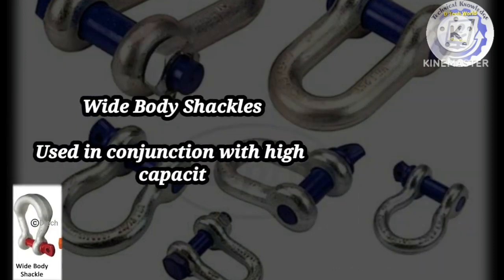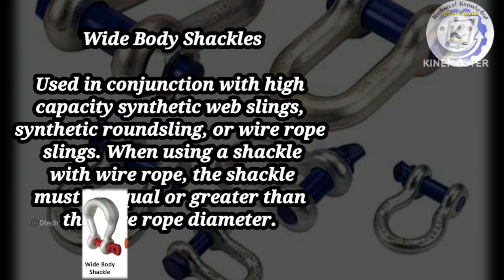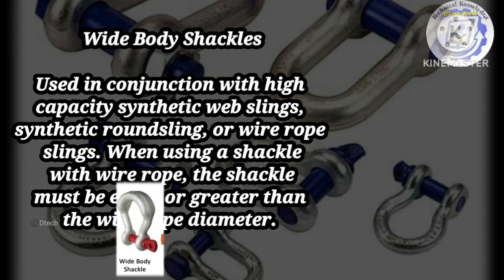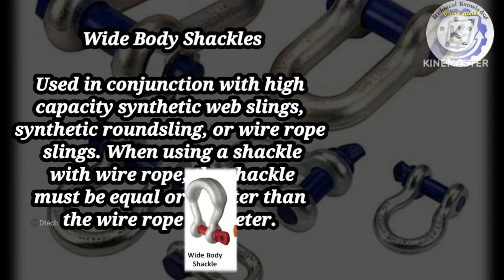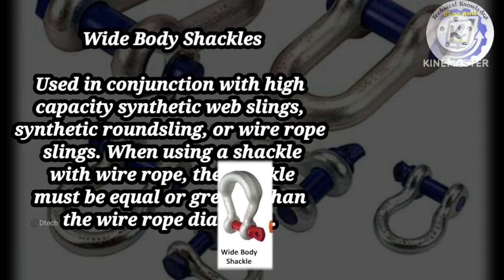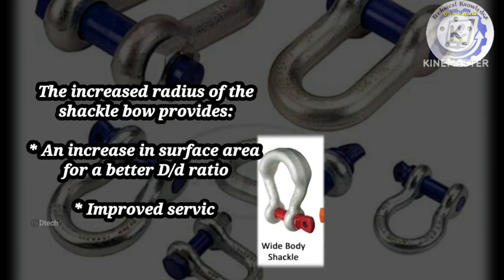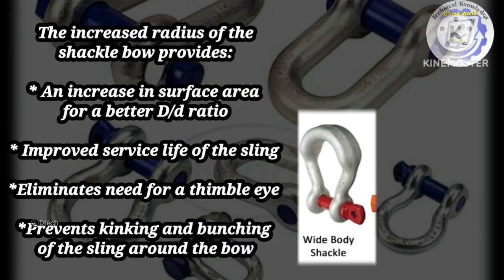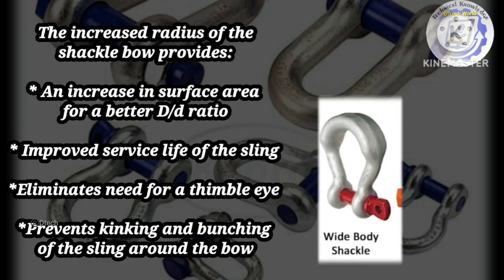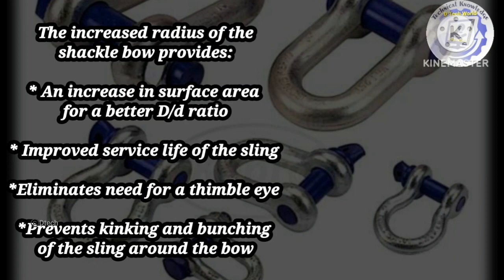Wide body shackles. Used in conjunction with high capacity synthetic web slings, synthetic round sling, or wire rope slings. When using a shackle with wire rope, the shackle must be equal or greater than the wire rope diameter. The increased radius of the shackle bow provides an increase in surface area for a better D/d ratio, improves service life of the sling, eliminates need for a thimble eye, prevents kinking and bunching of the sling around the bow.